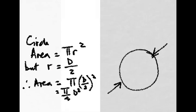Let's digress for a moment and just discuss why we prefer using pi over 4 d squared rather than pi r squared for the area of a circle in engineering. And that's primarily because of the fact that when we measure round objects in engineering, it's infinitely easier to measure to the outside of, let's say, a shaft or a pipe using a vernier or other device. Measuring radius of something like a shaft would be incredibly difficult because you can't get inside the shaft, it's solid,